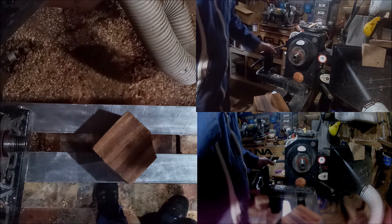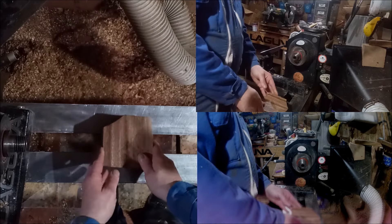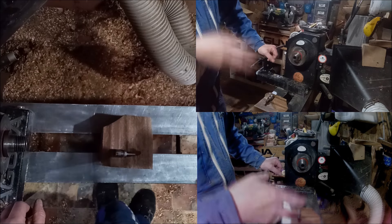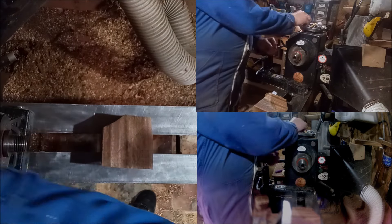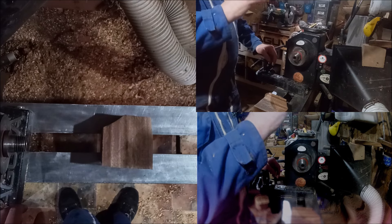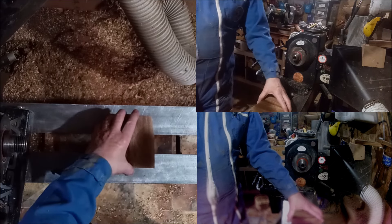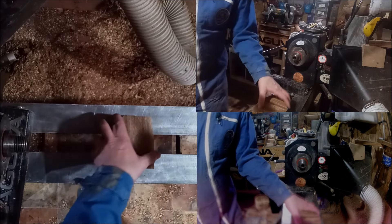I want to concentrate on thinking about what you're making before you do it. Now, I went through using a worm screw, but if the design was different and I was just making a bowl I could use one. Because this thing is going to be the shape it is, I can't use a worm screw — I need a raised section in the middle with a certain size hole, and a worm screw would take away from the height. So I'm going to put a face plate on so the center is untouched.